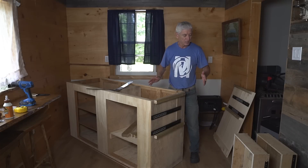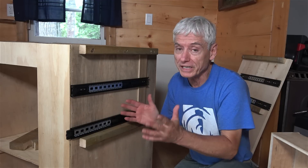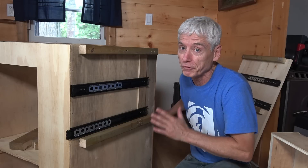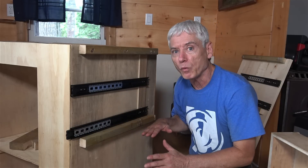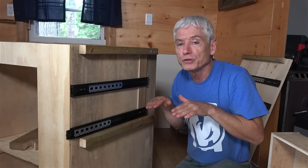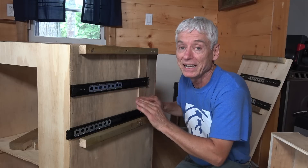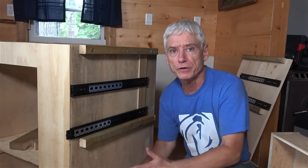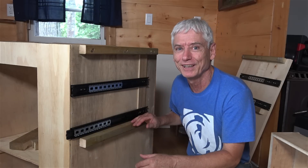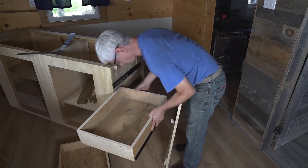I think I've got everything ready so I'm going to start assembling the drawer section. One side note: when putting sliding drawers on any cabinet you should do a fit-up where it's actually going to be used. When I put this cabinet back in place I found the floor has a slight tilt — if I just put the slides on where I thought it was parallel the drawers are going to be sliding out all the time. So I tilted them just a couple of degrees back to compensate, and added extra trim underneath to make sure the top is parallel. Assembling the drawers would have been a lot easier with two people but I managed by using my body to hold the end piece upright while I awkwardly inserted the drawers.